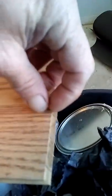You've got your measurement and you decided you want to cut this stuff. This edge is where you put your tape, not on this edge — you're gonna be short every time. Put it right here.